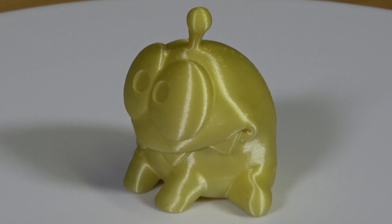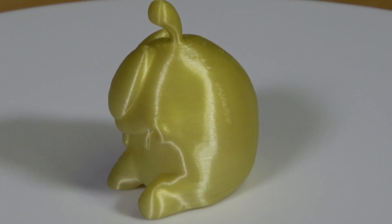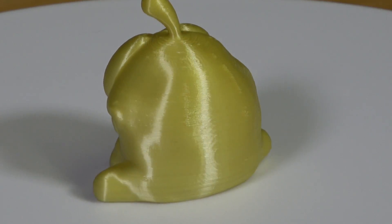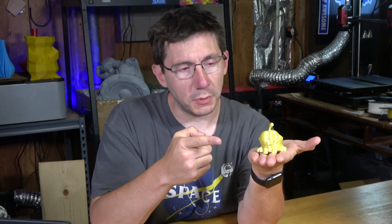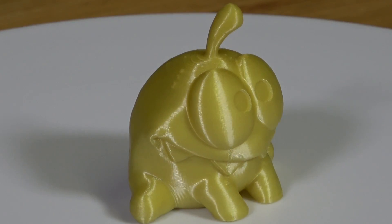This is printed using the Splendid filament from StrongHero 3D on the FormBot using Simplify3D, and I did this with a 1.0 extrusion multiplier. It looks like it's just a bit too much plastic, so let's change it to 0.95 and see what happens. At 0.95 for the extrusion multiplier it seems to be spot on. Now for the large one we're gonna scale it up to 400%. We're gonna use the variable settings wizard in Simplify3D to specify different infill percentages to save on the plastic.